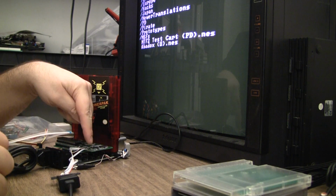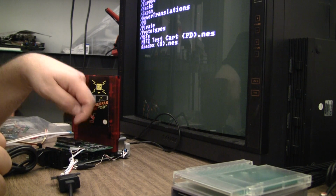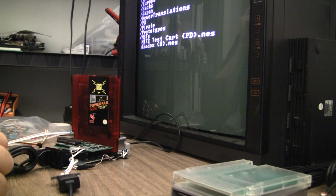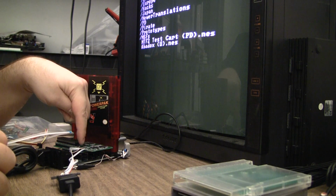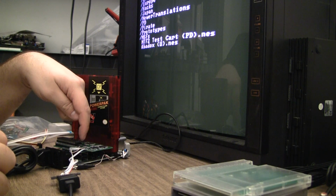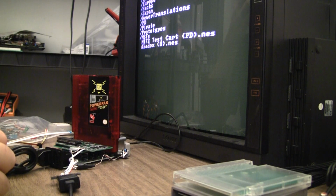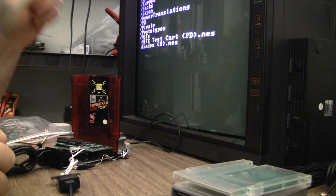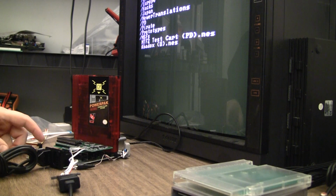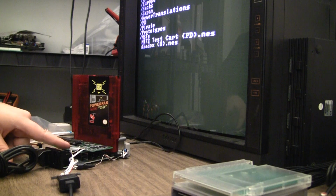Wasn't sure if I'd like these pads to solder to over the vias to solder to, but now that I think about it, it's probably a really good idea because you can solder and unsolder wires to the pads, and on the vias you basically have to desolder the vias and get the solder out of the holes to solder new wires to it, which I won't have to do this way.